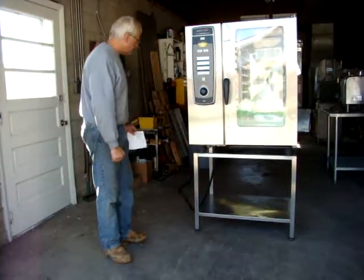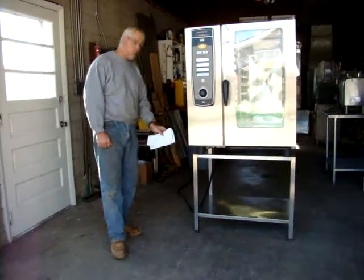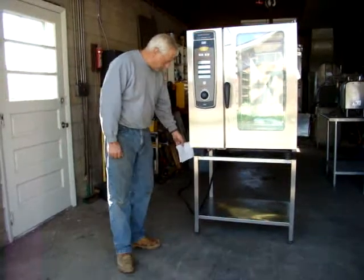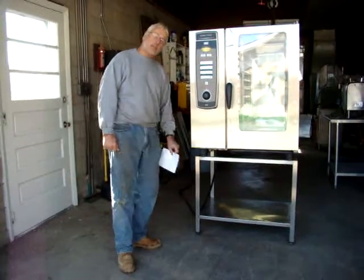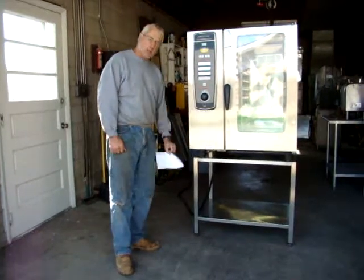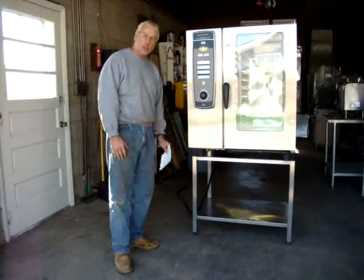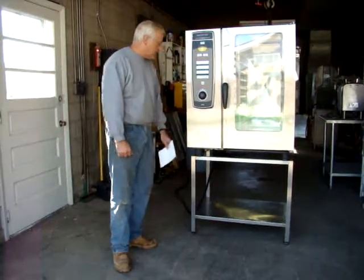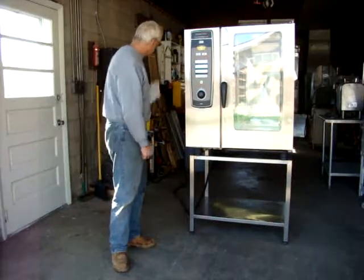Three phase power. It's in very good condition. What we're going to do is show you — we're going to turn it on. We have it wired up with a number six gauge wire. Whenever we sell the unit, the wire will come off and you'll be required to wire it up direct yourself. That's how it's usually done, with a four gauge wire. We have a six gauge wire on right now for purposes of turning it on to show you what runs with our three phase converter.